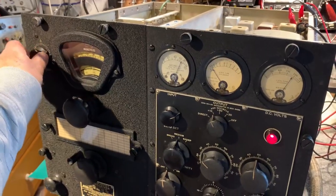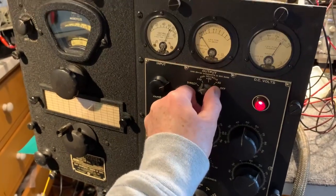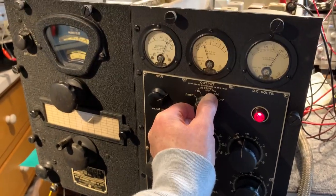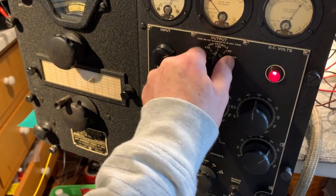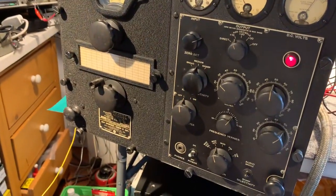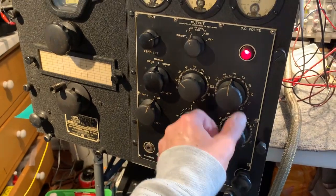It's got an antenna tuner that's working. This affects the output level meter. You can set it for direct for maximum movement, or plus 10 dB, plus 20 dB and so on. There's also a noise limiter, though it just distorts the audio.